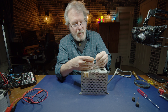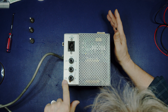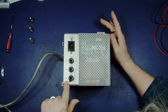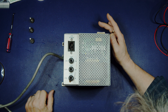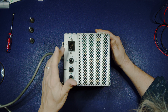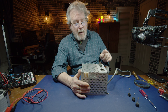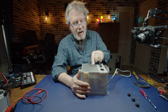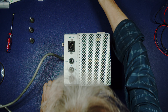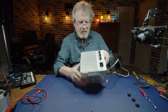Fast blow fuses are used in a power supply circuit that is not going to have a good deal of inrush current. Looking at this here - 35 volts positive, negative 35 volts - so it doesn't surprise me that there is a fast blow in those capacities. This one is labeled 'line three amps,' so this is no doubt, even without looking at the schematic, actually going to be a fuse for the power input to the power supply - meaning it'll have 120 volts on it. We're going to go ahead and change those out via Amazon. They are really, really tight. Let's see how we can get this thing unbuttoned.